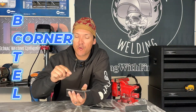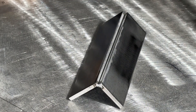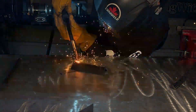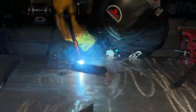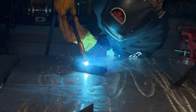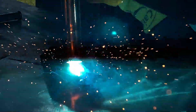Number two is our corner joint — we're focusing on the outside of that groove. This one's super common in sheet metal where you've got two pieces of material coming together to form a 90 degree or L shape, and we weld that little joint. With 3/16ths, we've got enough material to run a solid fillet. Hold a 45 degree gun angle pointing into the center of the joint and keep your wire right at the root. A consistent travel speed with a slight push angle between 0 and 15 degrees will produce a nice flat bead that's not too crowned up. Watch that you're biting the edges of the groove, just like we did with the butt joint.